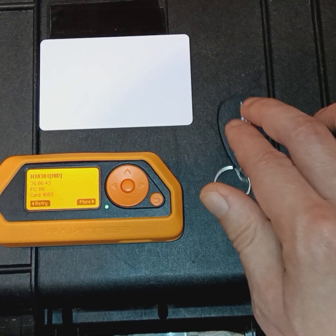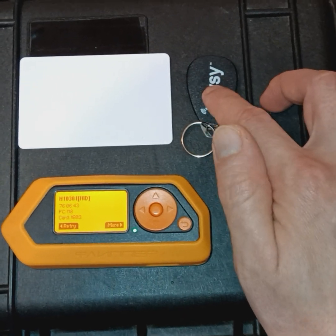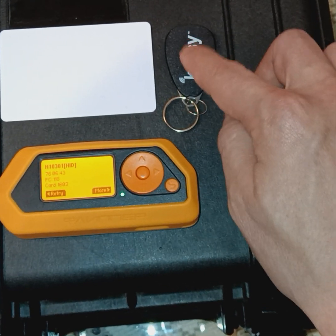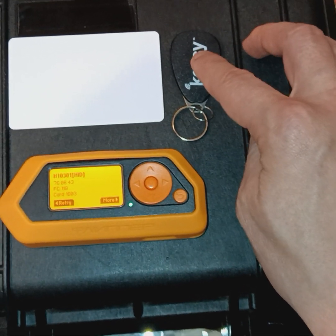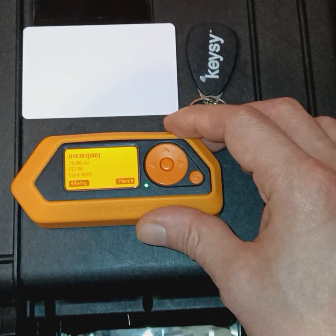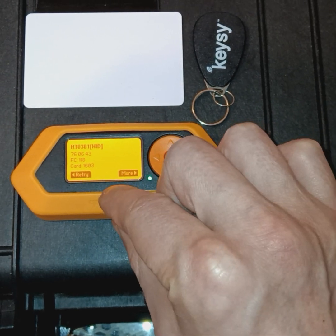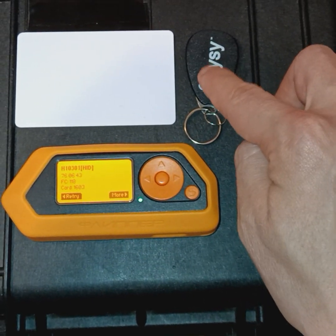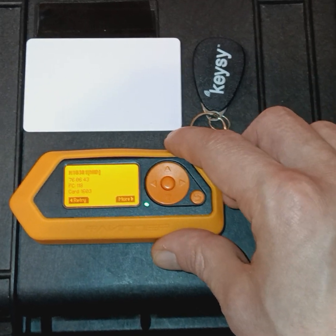This tag type is cross-compatible with other tags. It's a T55X series, which means you can copy and replicate other tag types to this tag. That's not something common with all RFID tags, but the T55X is one of those. So you can take different tag types — for example, a HID proximity pass — and clone that to the T55X, which I've done before this presentation.